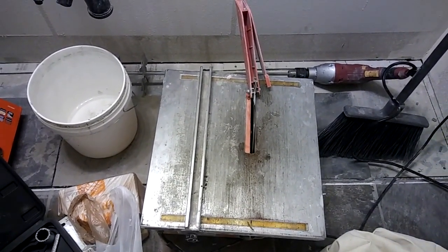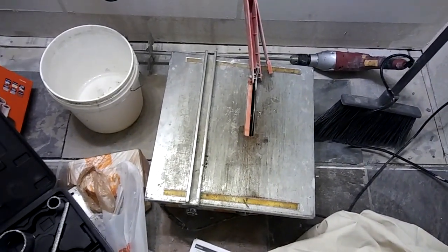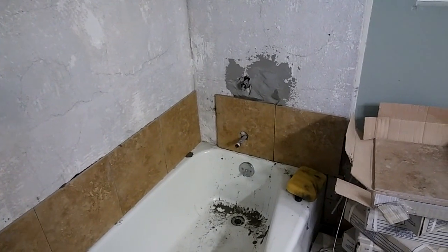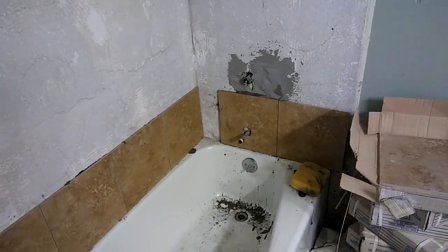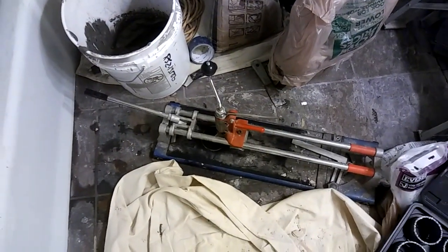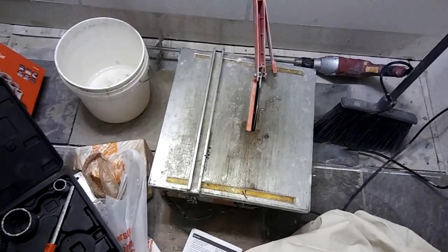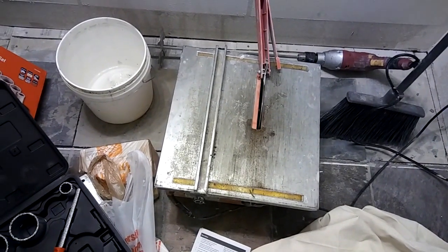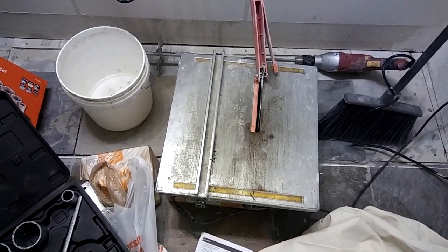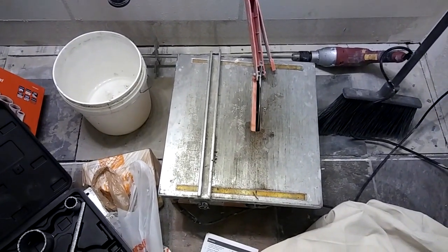You can find coupons online — just search '20% off Harbor Freight' on your phone. I started putting in some porcelain tile, and porcelain is pretty hard to cut, especially with the manual cutter. If you're trying to cut porcelain tile you cannot scribe-cut it — you have to have a wet saw. This wet saw I've almost worn out twice. I got it at Harbor Freight for around 40 bucks years ago and I've done like 10 showers with it.